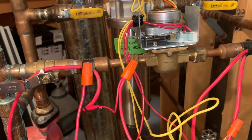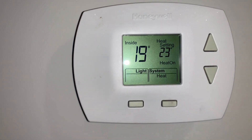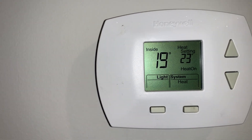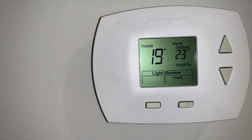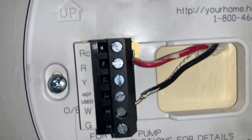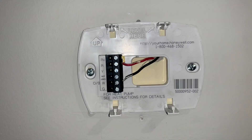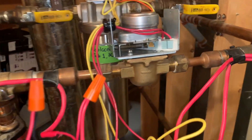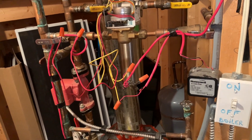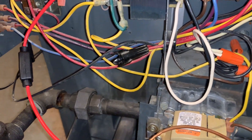I'm going to turn the thermostat on to heat — you'll hear it click. It is worth taking the thermostat off to ensure that those two wires are firmly screwed down, because that's another potential fault. Mine has two wires. You can put either a jumper or just unscrew them and join them together, which will complete the circuit. That's about it. I apologize for the long rambling video — I'm not an electrician, I'm not a plumber. It took me two days of screwing around with this to figure out, and at the end of the day my issue was with an inline fuse. I hope that helps somebody.